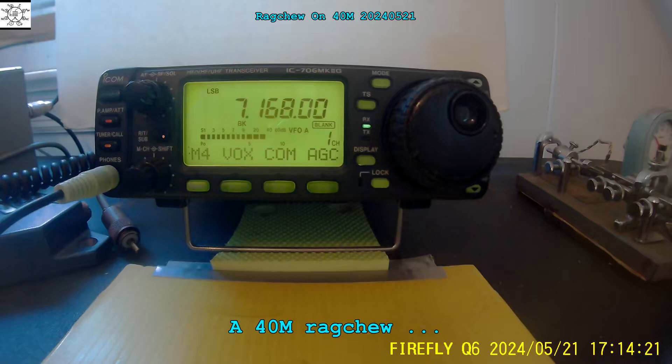That might be the location for the RFI. Right now I'm fighting an RFI problem — I have 15, 12, and 10 meters and it is bizarre. I've fought RFI my whole life and I haven't lost yet, but this one is challenging me. I've done antenna tests, AC tests. There are three areas: antennas, audio, and AC — the three A's.